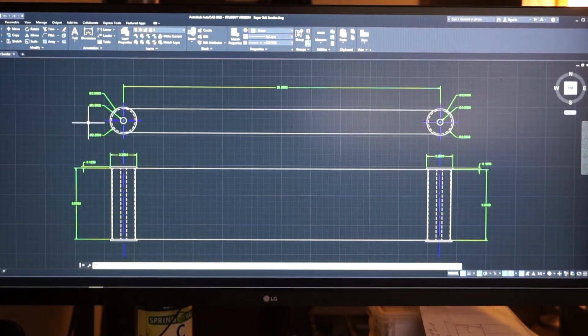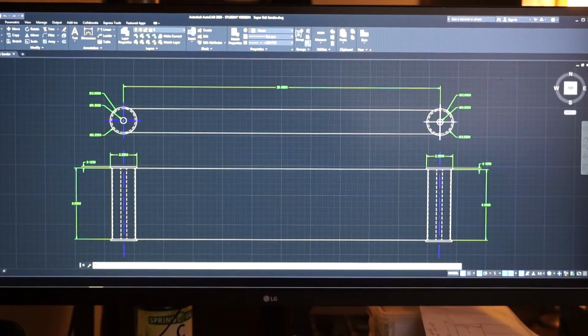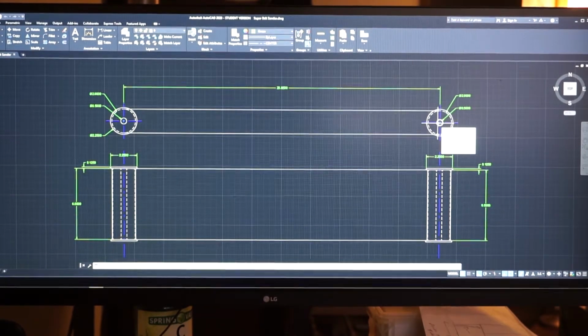And what I'm gonna do is run 2-inch rectangular channel across here and stop. The goal is to make this thing pretty powerful, relatively fast, I don't know how many surface feet per minute, but the motor will be a direct drive at 1700 RPMs. So it'll probably lag a little bit, but I'll probably have a gear reduction on it as well. And hopefully I can somehow couple the motor to this, because the motor's got some weird shaft size, like a 0.555 dimension. So I gotta shave a 1/2 inch hole just to make it work, but that's okay. I'll either ream it or I'll shave it since the drill press is up and running now. Yeah, this is generally the idea that we're gonna go with.